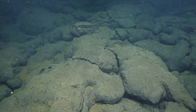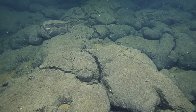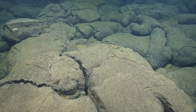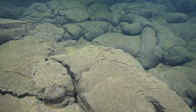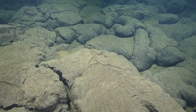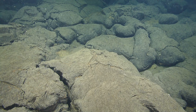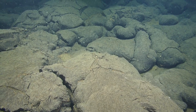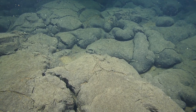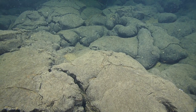So I'm going to put some trim in so the ROV is not floating excessively. You can see yourself there. I probably have a little too much trim in there, so I'm dialing this knob here, which is our Z-ballast. If I put that to like 25 somewhere, there's no autos on, I'm not touching the sticks at all, we're a little heavy, so I'm just going to play around with that number, so the ROV will be, in theory, slightly positively buoyant. You can see from Danny's camera how high the porch is. So I'm going to back off a little bit more. I do appear to be kind of heavy.